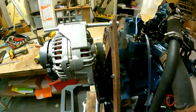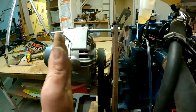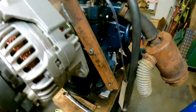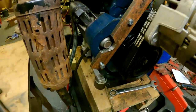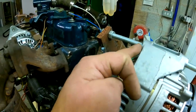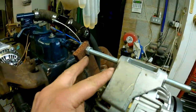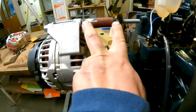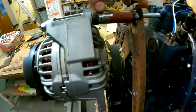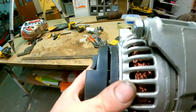I've got the alternator loosely mounted — I've just put some threaded bar in so I can get the distance left to right. It looks quite good. I'm going to find something decent and get a measure from there to there — something we can actually weld into part of the structure and brace down off it later. I've put this in temporarily and I'll put a collar in the end so it retains the dimension and we don't get any flop up and down.